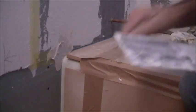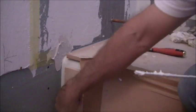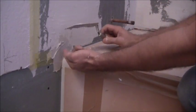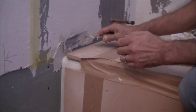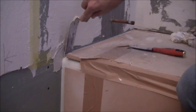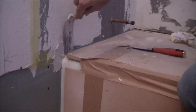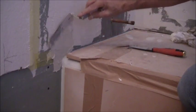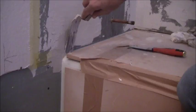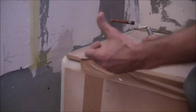I've already got that green board so tight that the waterproofing will touch the green board and then touch the tub, and I'll hit that corner right there really well. It's just that right here in this corner, where the green board met up with the cement board, there was that big gap that you saw. Well, now that gap is taken care of with thin set, and then I'm going to put in waterproofing material there, take care of that joint, and that's how I'm going to try to ensure as much waterproofing material so that both sides of the tub, this side and the other side, are both protected.